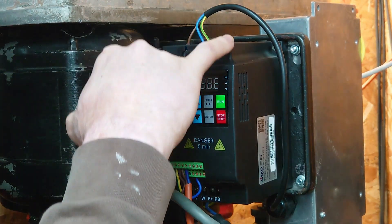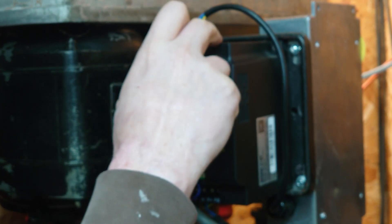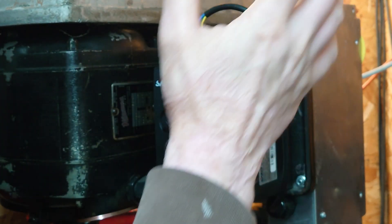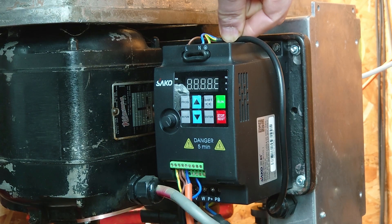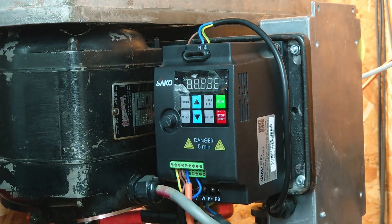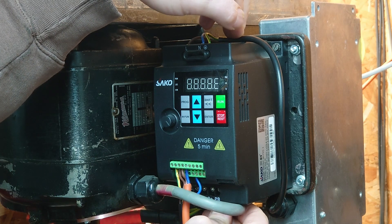What else can we do to improve this? We've got single insulation from the end of the outer down to the ferrules that the wires are crimped into. So I could add some heat shrink here which goes over the ferrule body as well, and then that would be fully double insulated all the way to the terminal. Finally there's no strain relief on that cable, and all that needs is a cable tie through one of those vents — that to me would be sufficient. I'm not saying this is the best way of doing it; I'm saying this is the minimal way. Obviously putting it in a metal box is absolutely fine, but I'm just saying it's not necessary. So I'm going to put the heat shrink on the wires and put a cable tie on each end just to strain relief those wires.